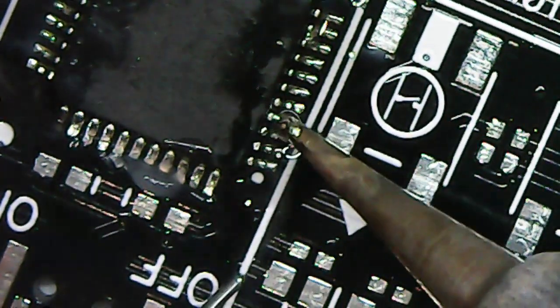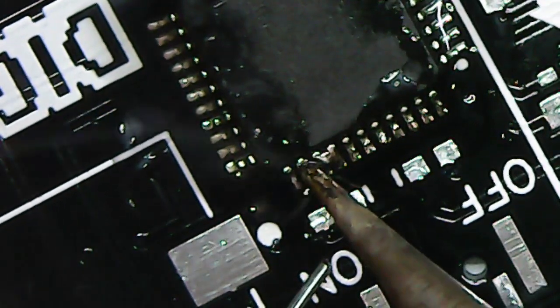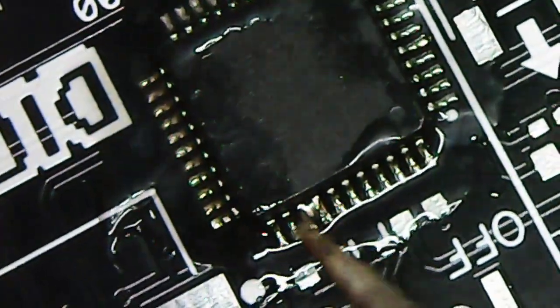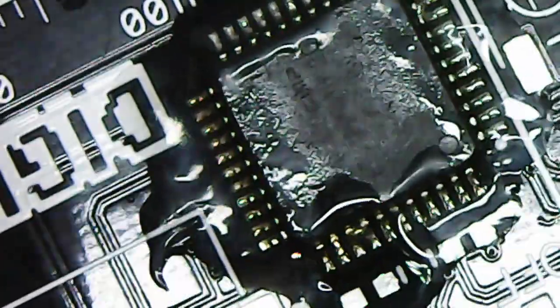Let's move to the next component: a 10K resistor. These are very, very small — 0201 size surface mount components. I can do these without a microscope and without reading glasses, though I do need them normally. Same technique as before: get some flux, put a little bit of solder on just one pad, then use tweezers to hold the resistor, reflow that solder onto one end, then solder the other side. Both ends are now soldered. It doesn't look extremely pretty, but it'll do the job.